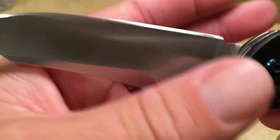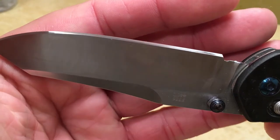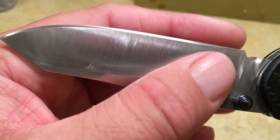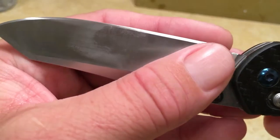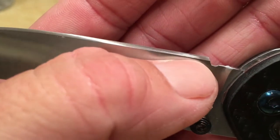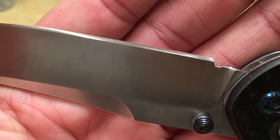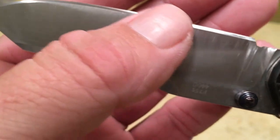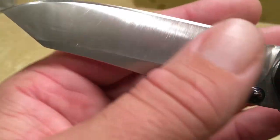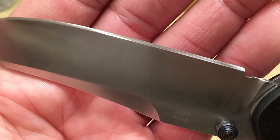So you may be wondering, what was the point of doing those countdown strokes, 8, 6, 4, 2, 1. The main purpose of that is if I had a burr on the knife, that will help minimize it or eliminate it altogether. I already knew the scratches were reaching from the top of the shoulder to the apex. So I was good there. All I wanted at that point was to just make sure there was nothing on the apex of the knife. So doing a countdown like that just helped minimize and eliminate any burr.